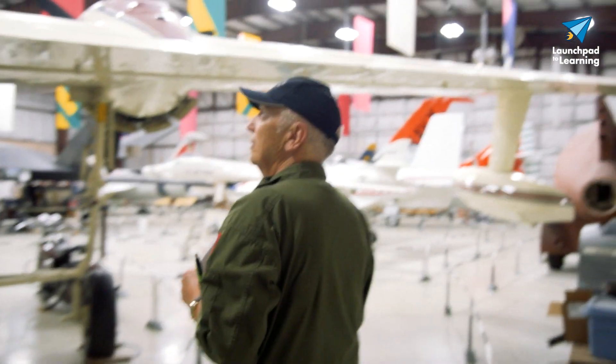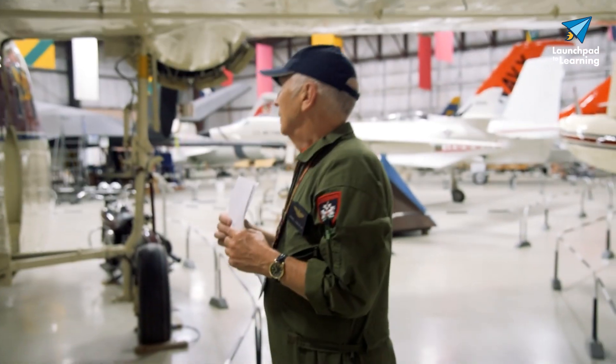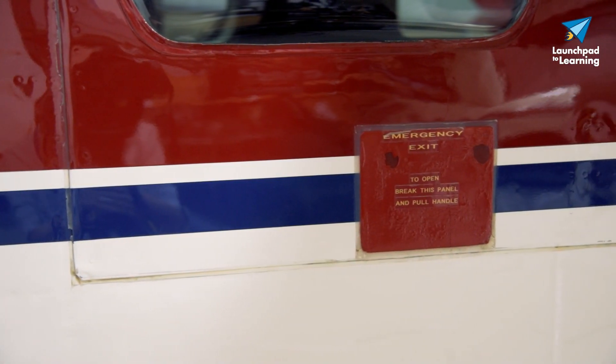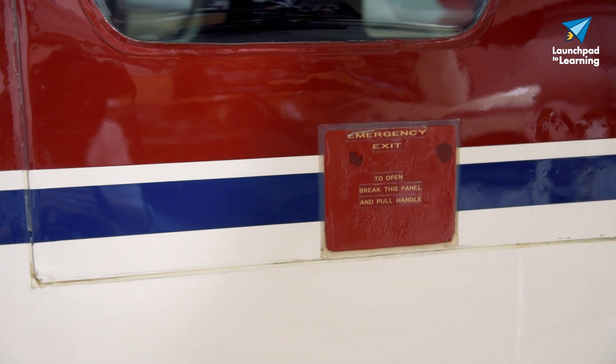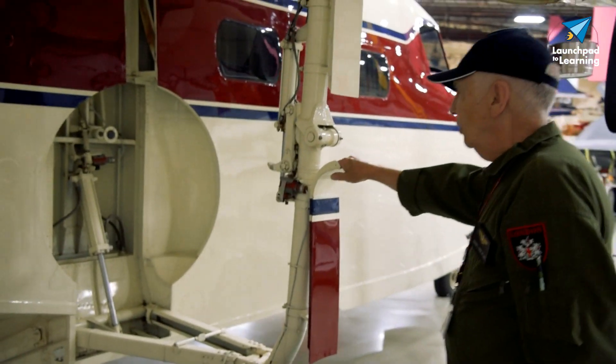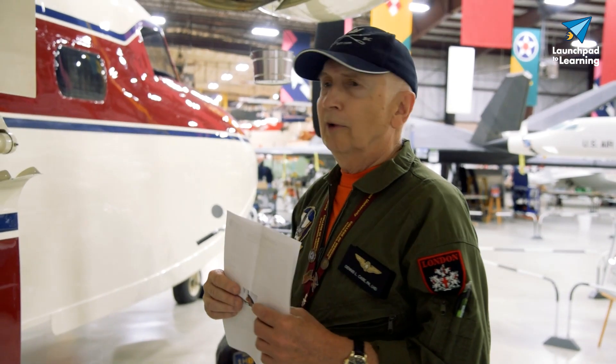This side is pretty much the same as the other side. There's an escape hatch right here — this panel can be opened on the inside and pushed out so we can deplane if need be. We have the same type of landing gear situation on this side, the way it pulls into the hull. The Grumman Goose, which I am more familiar with, had a different type of landing gear — more like on the Grumman Wildcat where the gear was pulled up near the nose and it had a tail landing gear.